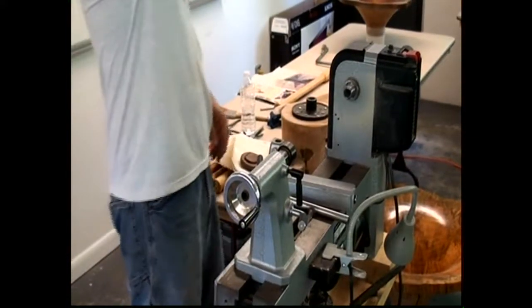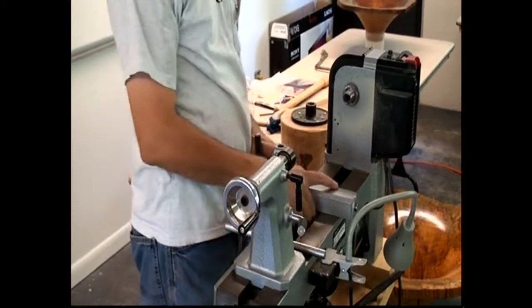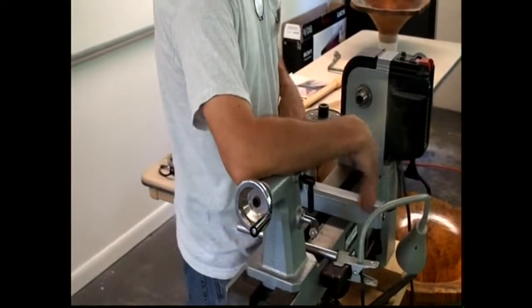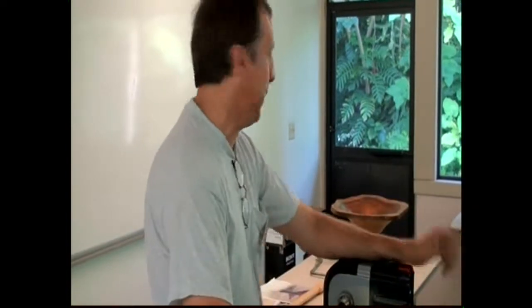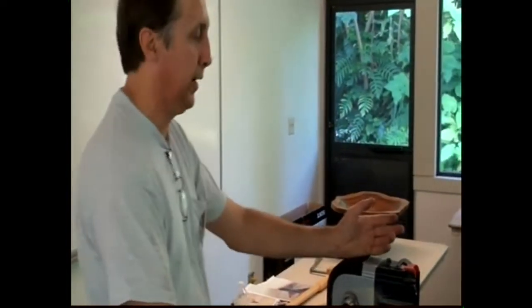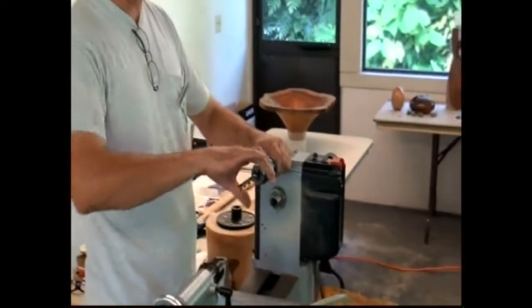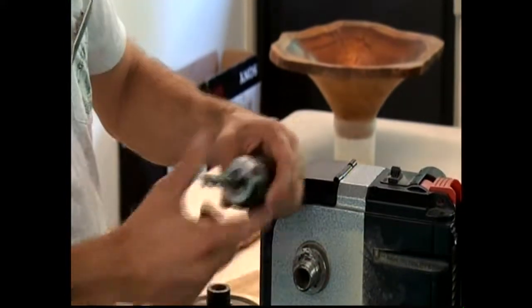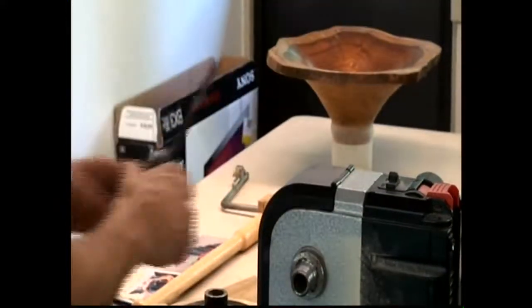Now, before I start, I want to show you something I came up with. It's probably been done before, but I've never seen it. But when I was up at the penthouse, turning on the balcony, I thought, I need a grinder. The first couple times I ran over to my studio, resharpened the tools and came back, or I was sharpening them with the diamond hone. And I thought, there's got to be a way to mount a grinding wheel on the lathe. So I had a Morse taper thing with the rod and I was trying to hook it up that way and it worked. But then you've got to bang this and get it out. So I thought,